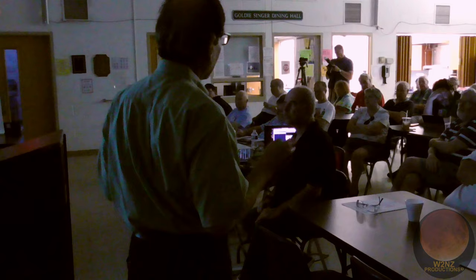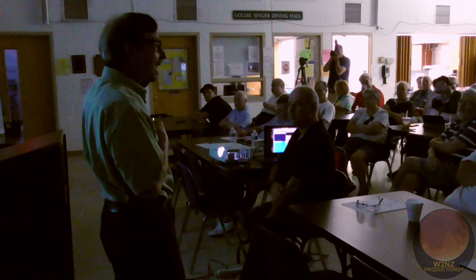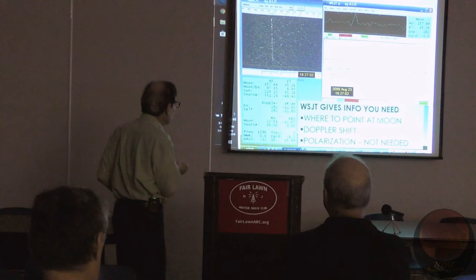At 3 centimeters, you know how much the Doppler is? It's over 30 kilohertz. You know what 30 kilohertz is like? It's really weird. You work in the sky, and you have to tune 30 kilohertz away to find them. And it's amazing, because he's there. The physics works. It really is amazing. So you want to correct for your Doppler shift at the higher frequencies.